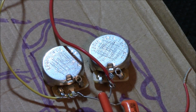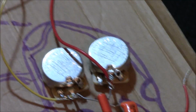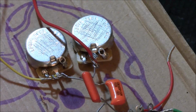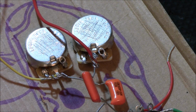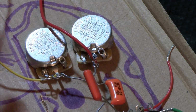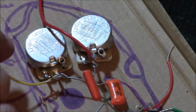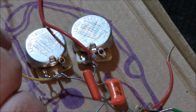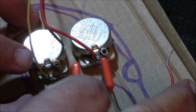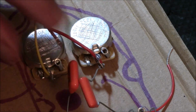So I've got to not only solder to the bottom of these, but also the sides of the tone ones. So you always make sure you do it fast, quick, and at as low a temperature as you can get, so you don't cause any problems. Some of these legs on these pots, I'm looking at right this minute, will have multiple wires running to them. And those, I want to do all at one time, and not have to come back and do them a second time. Okie dokie.